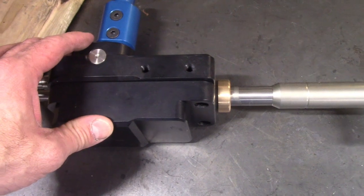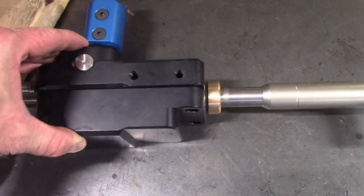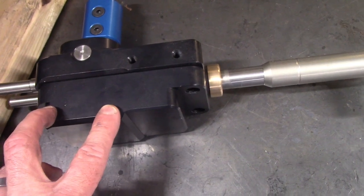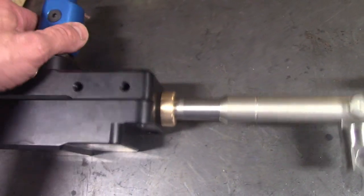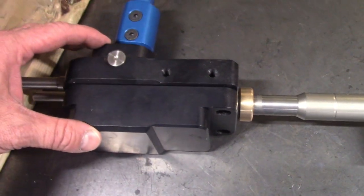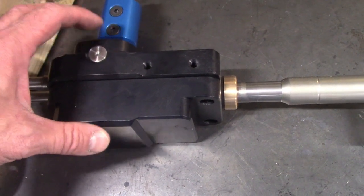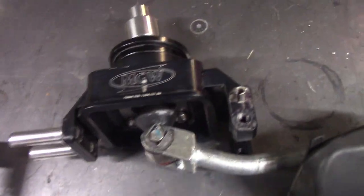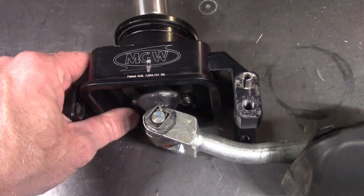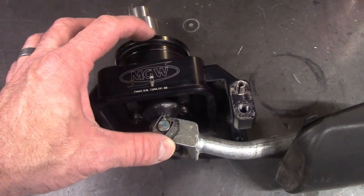Another piece of the puzzle I've been working on is the shifter. A couple of videos ago I talked about how my original idea was to use this GT500 shifter from MGW, originally intended for an S197 GT500 — a beautiful, well-machined piece. But it's really quite tall, which doesn't matter in the GT500 application but really doesn't work when I put a transfer case below it. Instead, I found a used MGW shifter for a fifth-gen Camaro. I'll need to extend the shift rod, but the mechanism is dramatically shorter — by almost an inch.